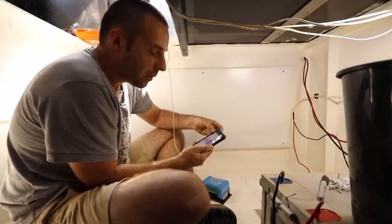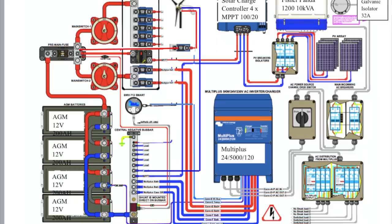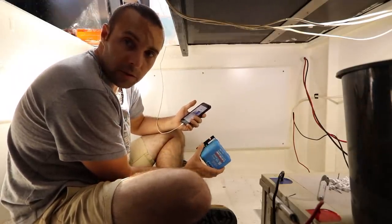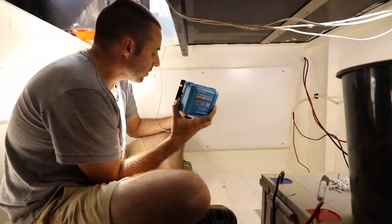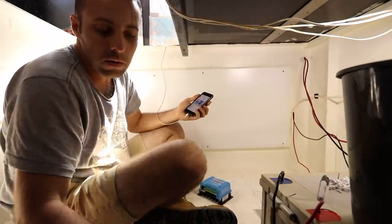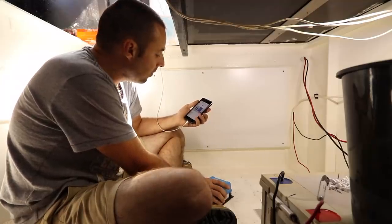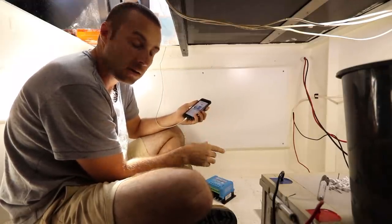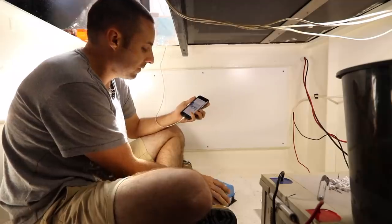I'm working to a wiring diagram that one of our viewers, Tim, did — I'll put a photo of it up on the screen. We're mounting the charge controllers; they're already going through breakers which are mounted at the other end of the boat as close as we can get to the solar panels, so it protects all the wiring running through the lounge downstream of the panels. They come straight into the charge controllers, from there into a positive distribution block, then through a switch (one of our Narva switches), then through an 80 amp breaker because we've got four of these combined which could be up to 80 amps, and from there off to our loads and distribution boards.